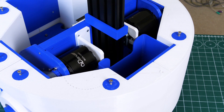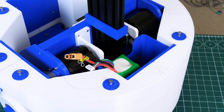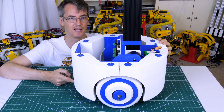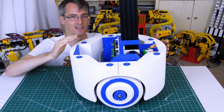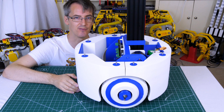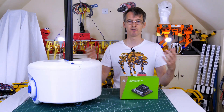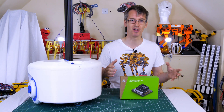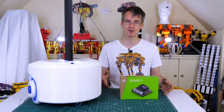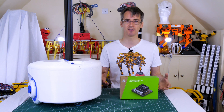I've made a battery pocket that drops in there for some LiPos — probably 24-volt packs for the main drive. The batteries and motors are right at the front and the stick is also offset forward, meaning the robot naturally leans forward. Even without springs in the suspension arm, this front-heavy design takes the load off it so we don't need very strong springs. To drive the robot and run ROS we need a microcomputer — the previous ROS robots used a Raspberry Pi 3B+ and Pi 4, but this one we're going to do much cleverer stuff.